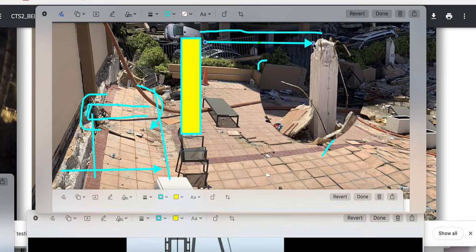Watch how — if I could swing this, it swings away — but the hinge point is here, not there. The hinge point is there, so it would come to rest on some vehicles under here, and maybe crown and fracture, but it would still have some engagement over there. Now if I do the rotation, it starts to rotate, but it's not for free. The other side is also engaged over here, so it stretches — the steel slides in the concrete, in all directions.